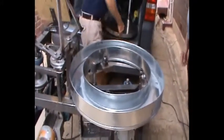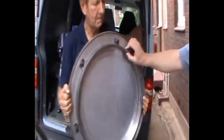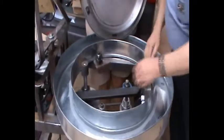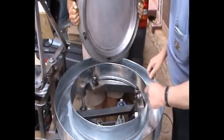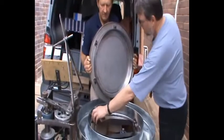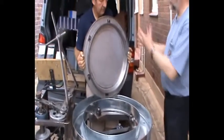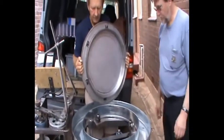Now I'm going to put the turntable on. This is the top of the turntable, that's the bottom part. This is a strong stainless steel band that's been machined on the inside to be perfectly circular and perfectly flat on this edge. This edge runs vertically onto these bearings, which is supporting the table — so this would take an enormous load. You could sit on it. These rollers will run on the inside and the rubber roller will provide the drive by friction. If for some reason things seize up, it can still just slip on here. That's the weakest link, but also the safety mechanism.